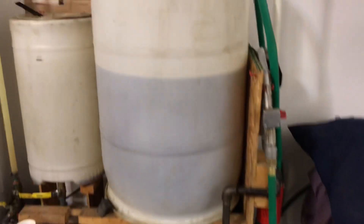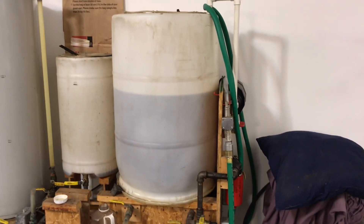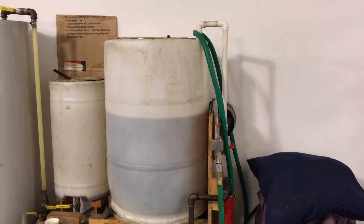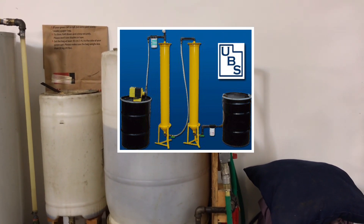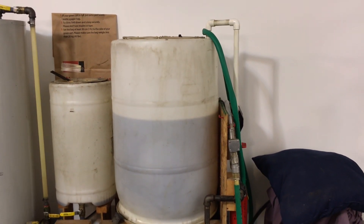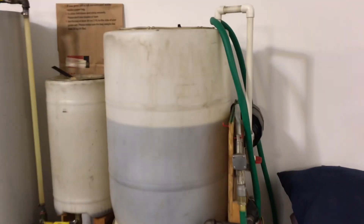So I've abandoned water washing in favor of dry washing. Now, another way to clean biodiesel — probably the best way but also the most expensive — is to buy wash towers. The biodiesel passes through filter media in the tower that filters out the contaminants. Those are expensive and take up quite a bit of room, but it's a really good way to go and I think it's the way a lot of home biodiesel brewers are going. I've opted for a different form of dry washing.